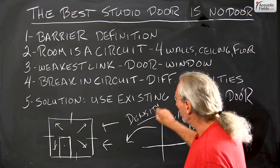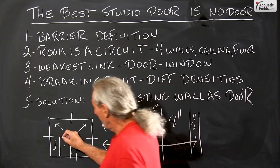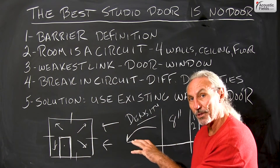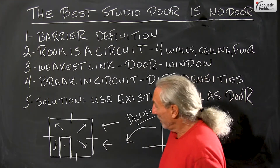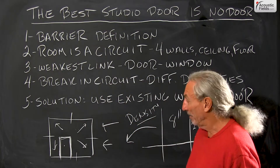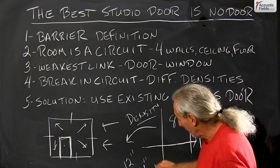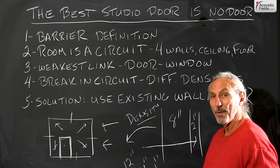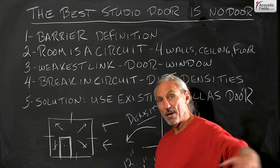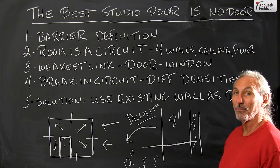That's why I say, with a play on words, the best studio door in your room is just no door at all. On all our designs, once we calculate the density of the wall that we're going to put our door in, we just simply frame out and carry over the same density that's in the wall. Yes, our doors can be 12 inches thick, our doors can be 16 inches thick — we're building one right now that's 24 inches thick because that's the thickness of the wall. We don't want to create a short circuit or a weak area in the wall where sound can get in. So view your room as a circuit, no breaks. Density is the key to keep the current flowing, so to speak.